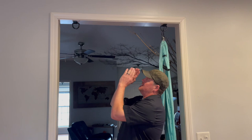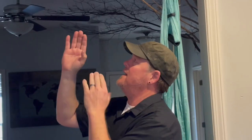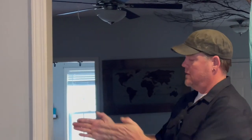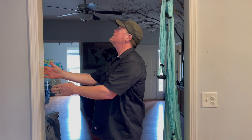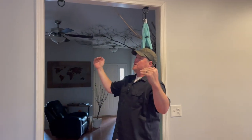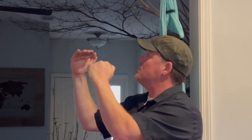Obviously I can't see inside the wall and I'm too lazy to rip it all apart, but in my head I know I have a two-by-four width-wise, at least here. So that's three and a half inches. Then I have a half-inch drywall, half-inch drywall. This is a load-bearing wall — I know that because my ceiling joists go this way, so that weight is on top of this wall.